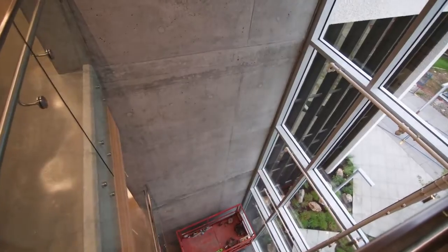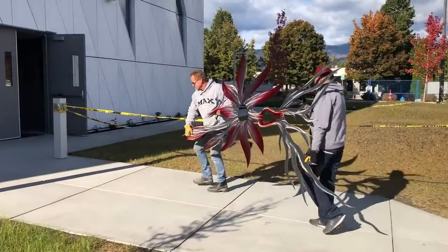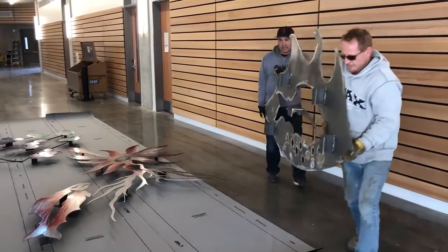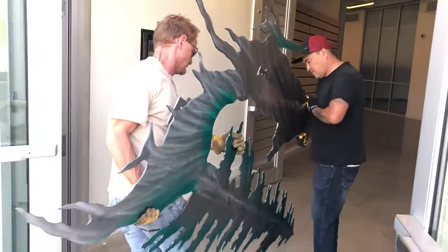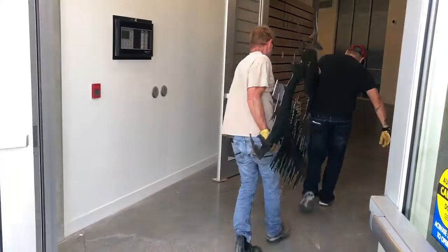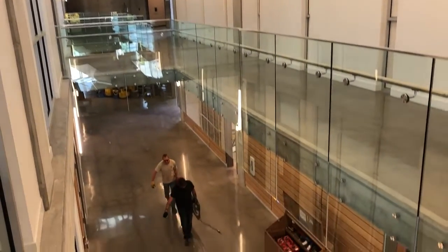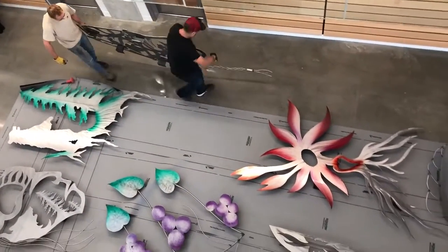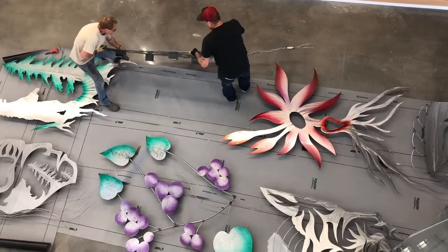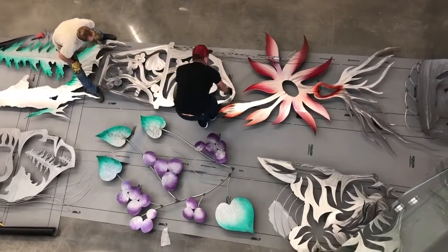From there I figure out about how much steel I'm going to need, then I buy sheets of steel. Every single one of the images I've ever created is hand cut, freehand cut. I usually use my garage door, lay down some tar paper and some chalk, do some measurements, and just freehand draw it on there. Once I put it onto tar paper and cut them out, I put the images onto the steel, draw them out with a Sharpie — all the images and all the detail — then take my plasma cutter and just start cutting away. Once those images are cut out, it's a process of putting on brackets, final touch-ups on the steel to get rid of burn marks and bluing, and then we go to a clear coat.